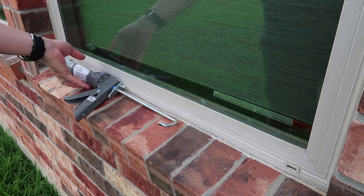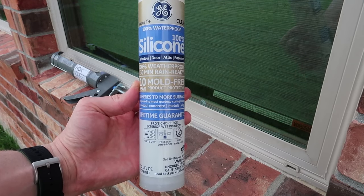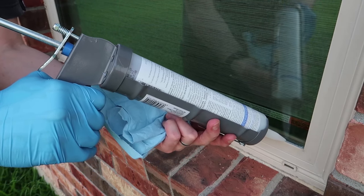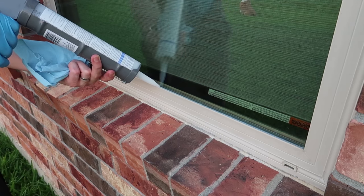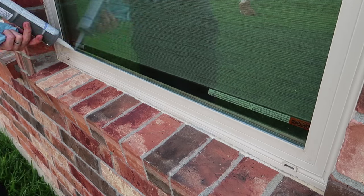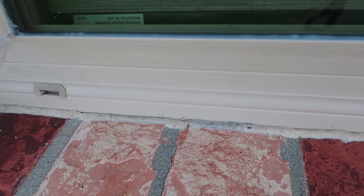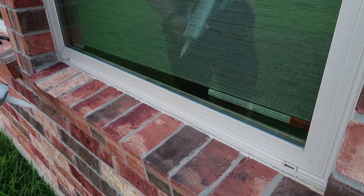Now that you've dried out the inside of the window, it's time to seal the outside as much as possible. I used clear silicone sealant from GE — it's 100% waterproof, mold free, UV resistant, and made for the outdoors, which is very important. Cut a small hole in the nozzle to lay down a really fine bead right into the gap between the frame and the window. We're not going to completely seal the window, but the goal is to keep water out and prevent moisture from getting back in. Pay extra attention to the corners and fill any cracks or gaps you find. In my case the window frame actually had some cracks in the corners that looked like they were from the manufacturer, so I filled those up too.